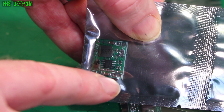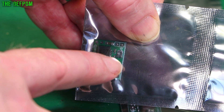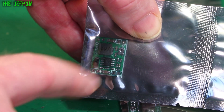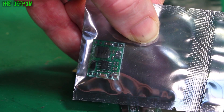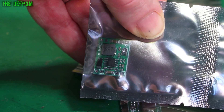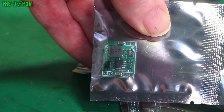Instead of having a resistor there, they make a variable one over here — those are linked together. So you can make an adjustable buck regulator, or a fixed buck regulator by inserting a resistor. It's quite a versatile little design — really cheap to get, very handy for projects and little things you're working on. There'll be links for these obviously.